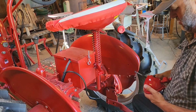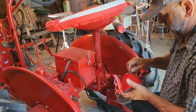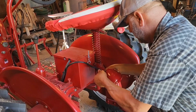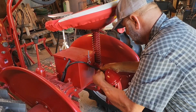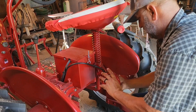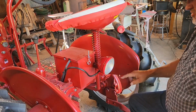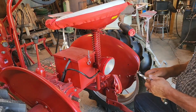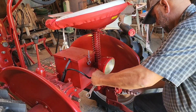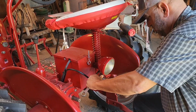Okay, we got our light over here. So I think we're going to make our wire connection first, because once the light's mounted, the screw's not so easy to get to back there. Probably going to lose a little paint going on, but that'll make sure we get a good ground too. We'll go just to the end here, so whatever paint we lost is inside. So let's rotate this light up to where it needs to be. So get a couple wrenches and we'll tighten that up. Alright, for this process we need a 13/16 wrench and also a 3/4 inch wrench. Tighten this onto that bracket.